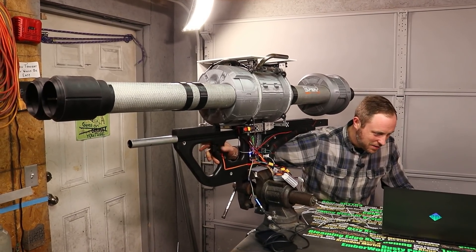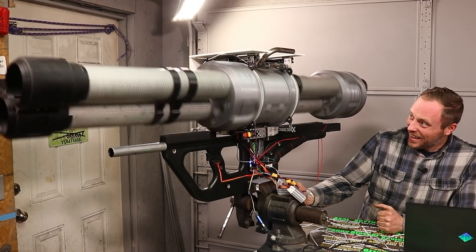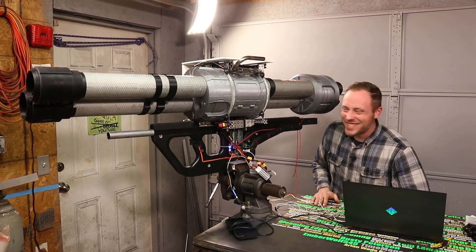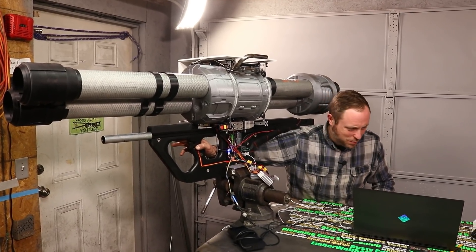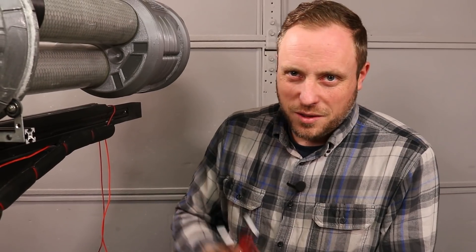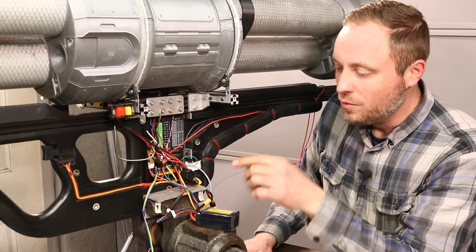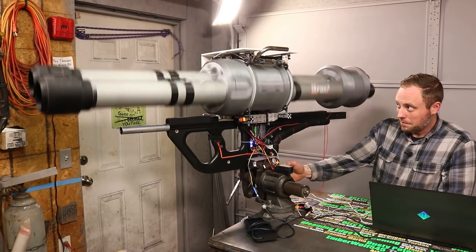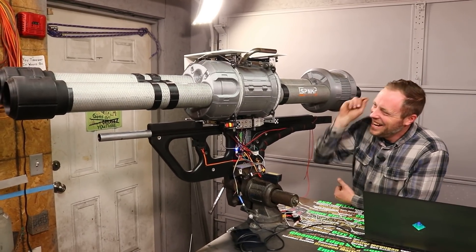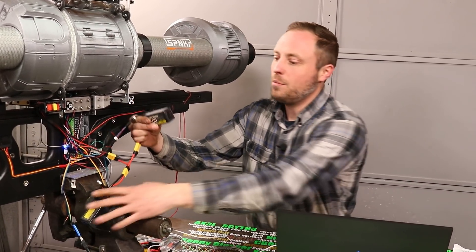Let's see if we can do 70 — we don't actually need to, but why not. She's flying now. Let's go for 80 — it spins so fast. 90? Let's just keep going. We're not doing 90 — all we need is 60 and we hit it. I do have stronger batteries and I'm dying to see how fast this can actually go. Eight cells running the system instead of six — this can handle up to 42 volts and even with the bigger batteries we're only at 33.6. 90 RPMs. Going for 100 — it really wanted to do it. 100 is the limit. 60 RPMs is exactly what we need, and with the higher cell count batteries, we're good to go for the next two tests.